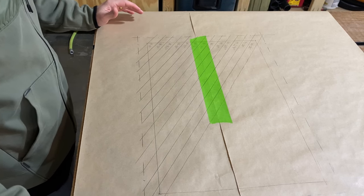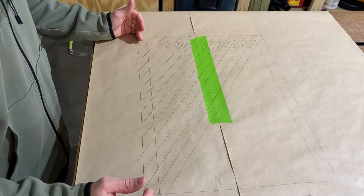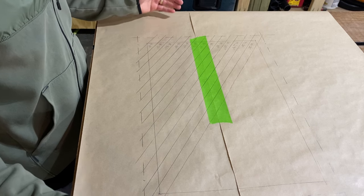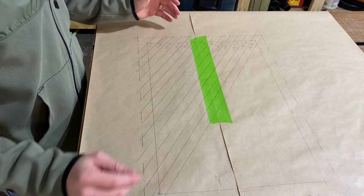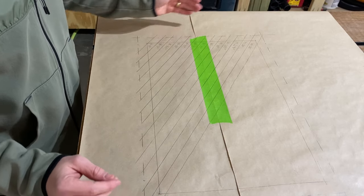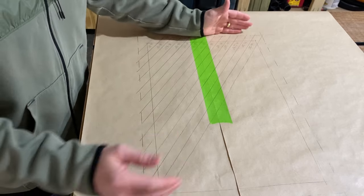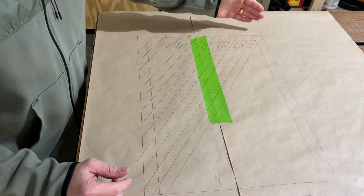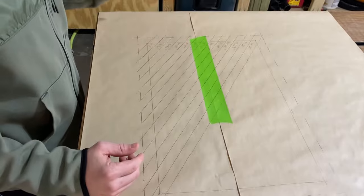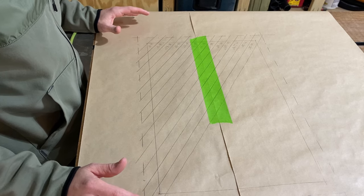Here's kind of a top-down view of a template that I drew out for this cutting board. I tried to do some math — part of the reason I think people don't make these is because there can be a lot of waste involved, and I'm trying to offset that. I put down on paper a 12 by 18 inch cutting board, my typical size, with three-quarter inch thick stock as the width of each board. I just stepped it down diagonally to see how long each piece needed to be. You always want to leave a little bit on either side for cutoff to get the board down to final size — I left an inch. It was a little time consuming, maybe 20 minutes, but I think it'll be well worth it.